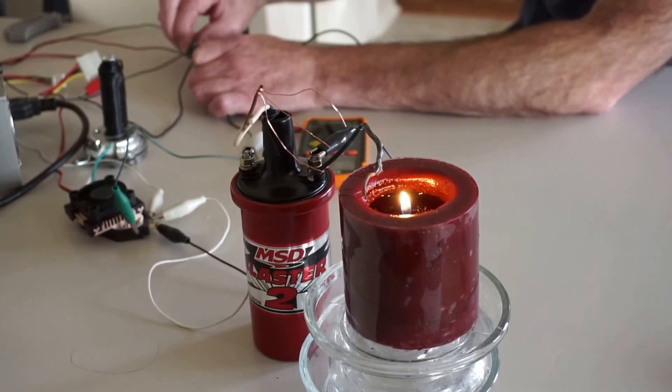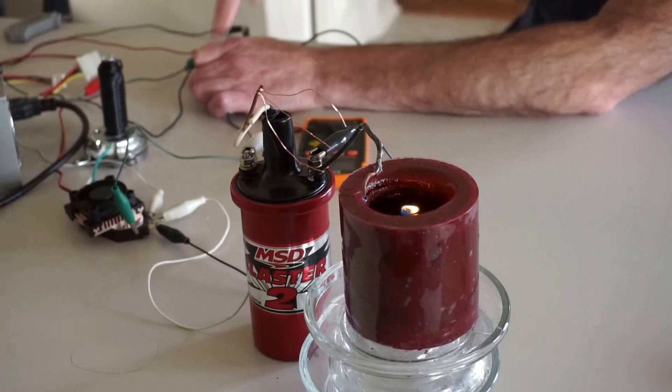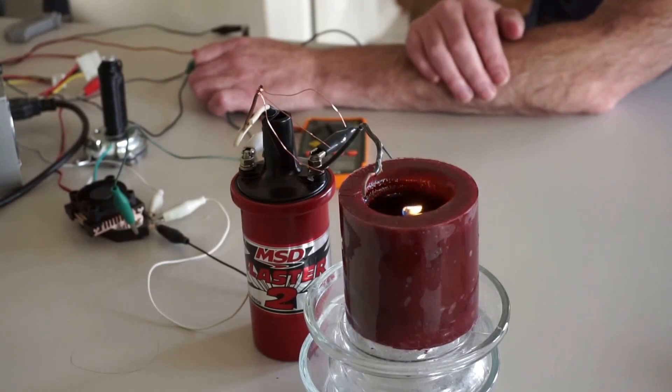I had a CPU cooling system. This control module is a transistor — it gets hot, so I put that on there to keep it cooled down and stable. The electromagnet was also getting hot, so I put the output of the power supply fan across it, and it's keeping it cooler.